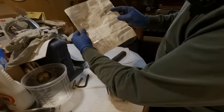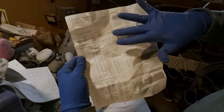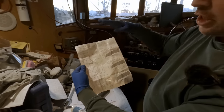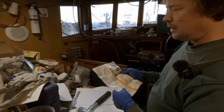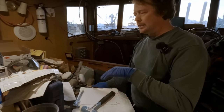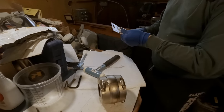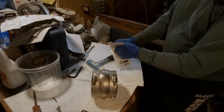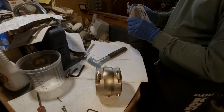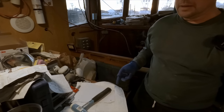I talked to a gentleman named Chris, down in Texas. He totally lined me out on what I need to do — how much grease to use, which varies by shaft speed and bearing size. There's a chart that tells you whether it's 100%, 75%, 50%, 33% pack or less, depending on shaft size and rotation. He gave me helpful hints and a good grease recommendation for the temperatures we'll be operating in. Really good customer support — great to be able to call somebody and get an answer right away.